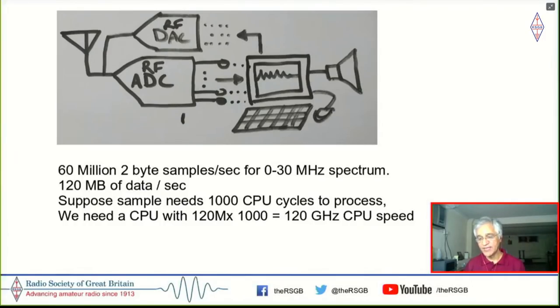Very simply put, if there's a wave that you would like to capture, a sine wave, you need to at least make two measurements for every up and down of the signal. So a sine wave goes up and then comes down, right? So you need one measurement at the top of the wave and one at the bottom of the wave. If a wave is going up and down, let's say a million times a second, you need 2 million samples to be read out for you to accurately know the amplitude of that particular signal.